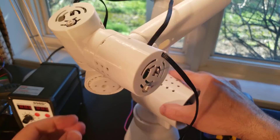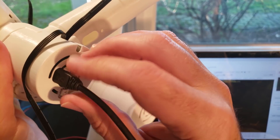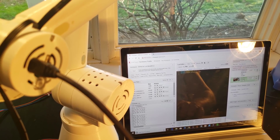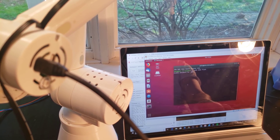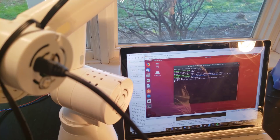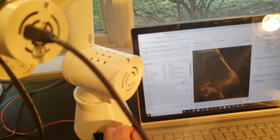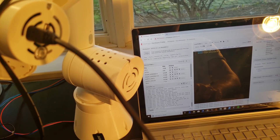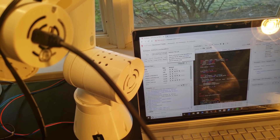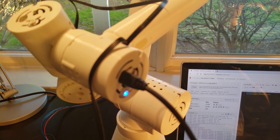Now you've got to program the firmware, and there's that nice USB port. Once it connects to the computer, I uploaded the latest NodeMCU ESP32 LUA firmware. I wrote a new stepper motor module for that firmware — I'll eventually check it into GitHub into the main repo if the guys will have it. The moment that blue LED comes on, you've got proof of life that the electronics, the soldering, and the code are all running correctly. We're about to see that blue light go on, which is a pretty magical moment — and there it is, running from the LUA code I wrote.